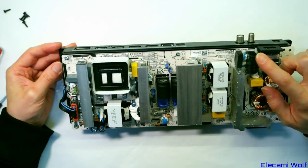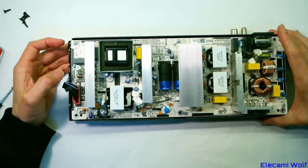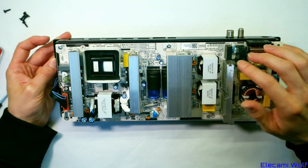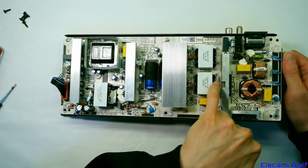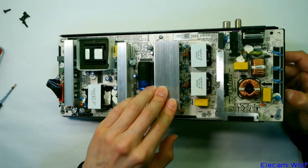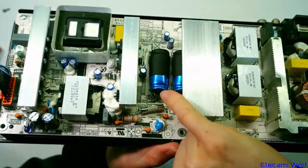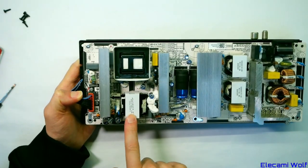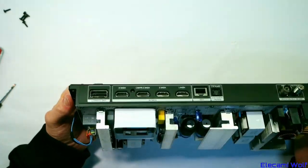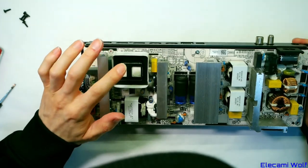The power comes in here, there's a relay — two relays, one must be a pre-charging one. There's standby filters, two rectifiers in parallel with provision for a third, probably the power factor chokes, and different footprints available with more holes for bigger versions for higher current. There's provision for bigger capacitors, then transformers — one must be the standby and one is the main power that goes to the panel. The output is supposed to be 350 V, so it's probably a one-to-one transformer for isolation.